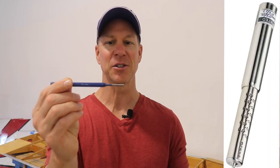One thing I noticed when pulling the fabric off the wing is that a lot of areas felt kind of brittle. There's actually a tool that tests aircraft fabric to see if it's still retaining its proper strength — it costs around $900 to $1,000, which is why I decided not to buy one. It looks kind of like a center punch and has a built-in gauge. You push it on the fabric with a set amount of pounds of force, and if it pokes a hole the fabric is no good; if it doesn't, the fabric passes.